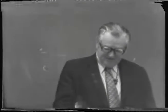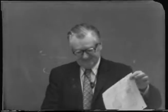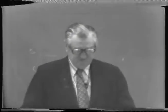Well, anyways, now a few words about the distillation, and perhaps maybe I could explain that better in a few minutes if we turn to the last page here. I think you can look through the chart yourself and figure out the flow pattern. Maybe we'll take a little more time later when we have to go through it more. But out of the fermenters, which is in the middle of the top page here, first page, then it goes dumped into a beer well, so-called. The fermented mash is called beer.